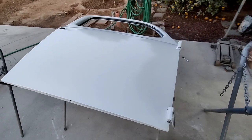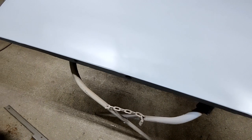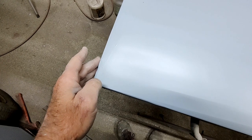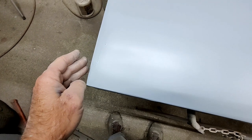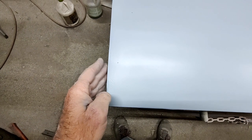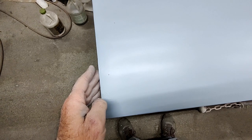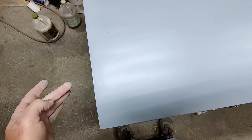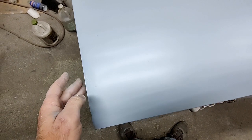Starting with filler — we're almost done. Please like, share, and subscribe — let me see your comments and hopefully this helps you get through a repair like this. Going slow-mo here so you can see it's pretty straight. I do a lot with blocking — a lot of guys do it only with filler, but I do a lot with the blocking and priming, and that's why I've been doing it for years without failures. I'm using a really good high-build primer — Tamco's 5310 is a really good high-build urethane primer, check that one out. Talk to you guys in the next video — please like, share, and subscribe.